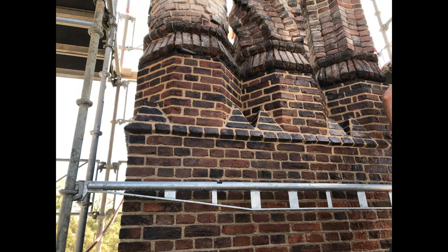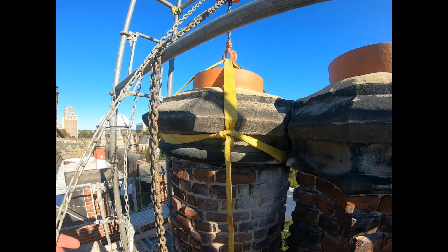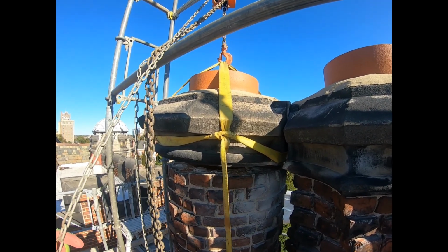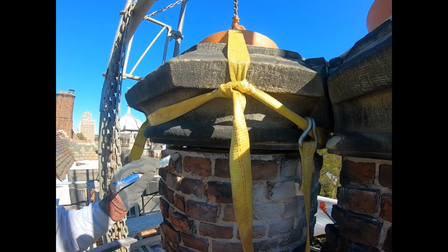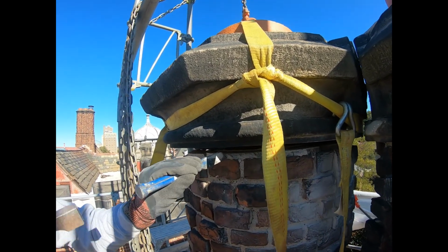The appearance of the repointed masonry will vary greatly, depending on how the joints are tooled. When doing restoration work, it's important to try and blend the repaired joints with the surrounding masonry. It is important to keep the mortar within the joint itself and to avoid smearing it on the face of the brick. It also helps to cut the mortar back on a slight angle to reveal approximately 1/8 of an inch of the brick at the edges.